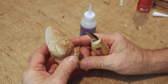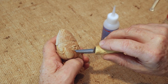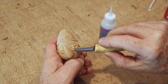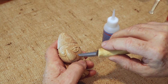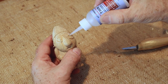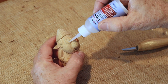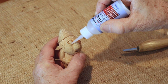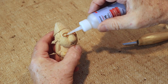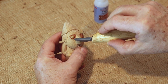Here's another carving I started in soft wood — I'm learning my lesson with this stuff. Around the eye I'm trying to do this little detail with an eyelid and eyeball, and it's hard to carve — kind of crumbly. So I can use some thin CA, just put it around the eyelids that are going to crumble, and the eyeball. Now I'll be able to carve that and it'll at least have a little more integrity. It's going to soak in.